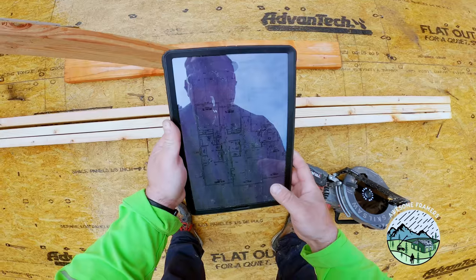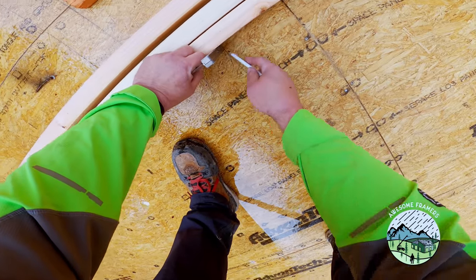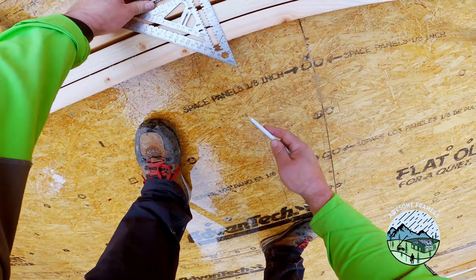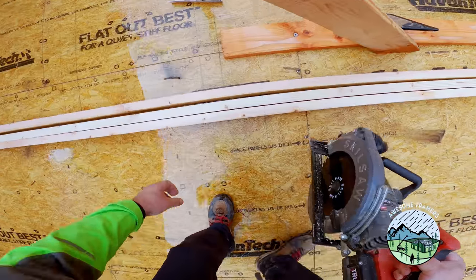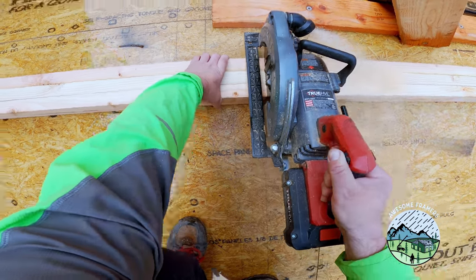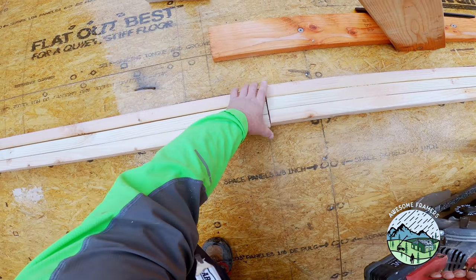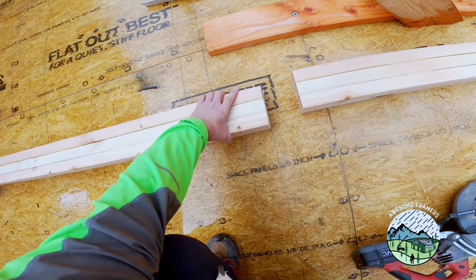The reason I do that is because as I go up the ladder when I frame walls, and you'll see that in a moment, I'm going to strap them. I have to strap them to the exterior wall. So my thinking is I'll just do it on the inside, and then I can use my 10 1/4 inch saw to cut them right over the line, perfectly identical at one time.